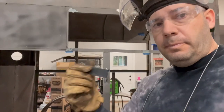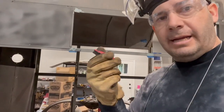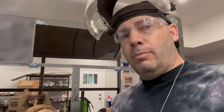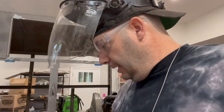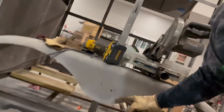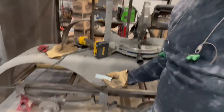I'll be putting this flat against there and holding it in place with these magnets — just welding magnets, like three or four bucks at Harbor Freight. They're not too strong, but they come in handy for stuff like this. I'm kind of out of the reach of a C clamp or vice grips since it's in the middle of there, so holding it with magnets works fine.